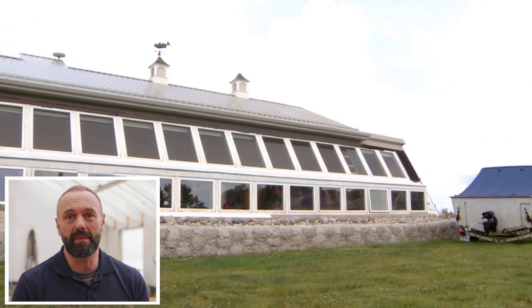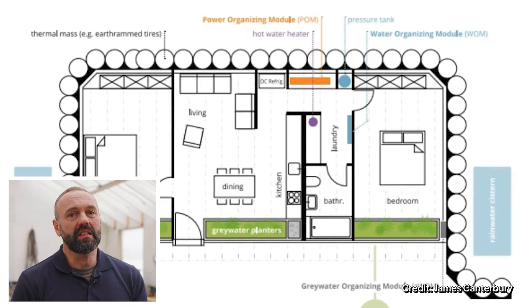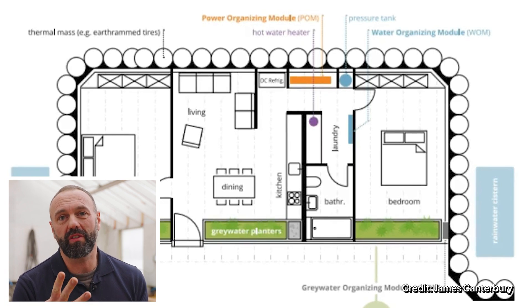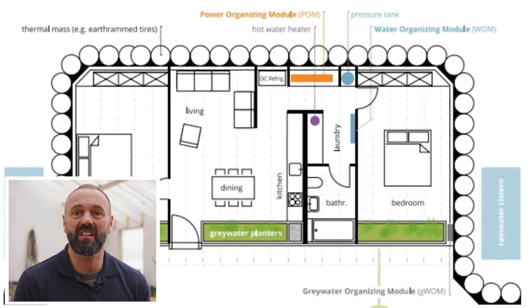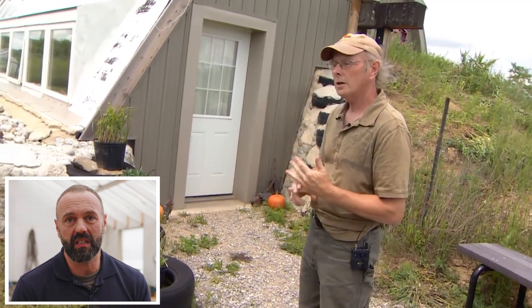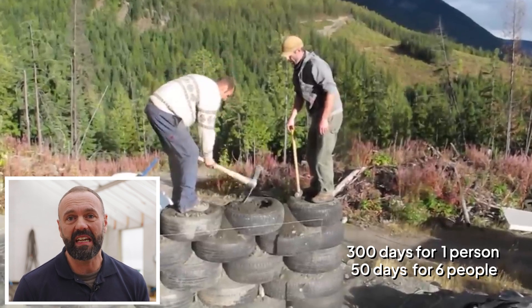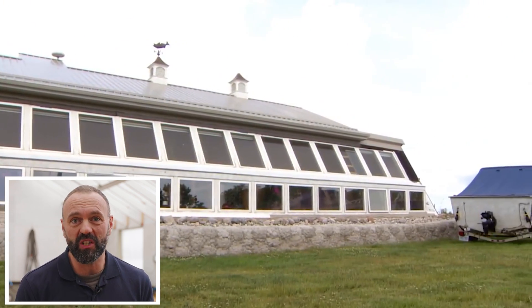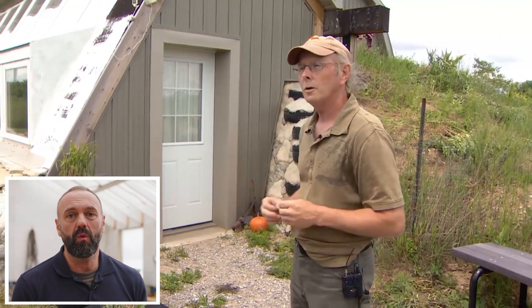In the next video, we're going to look at an earthship. One of the things I absolutely love about earthships is that they use garbage that is now native to planet earth — they're built out of tires and beer cans. But what's a bit misleading is that each tire has about 400 pounds of earth in it, and you have to fill those tires manually one bucket at a time, then take a sledgehammer and pound that earth into the tire. Michael Reynolds, the father of the earthship concept, said a really good tire pounder could pound six to ten tires a day, and the average earthship has between 1,200 and 1,800 tires in it. There are lots of unfinished earthships because people get so disillusioned with pounding earth into tires, and I usually talk clients out of it specifically for that reason.